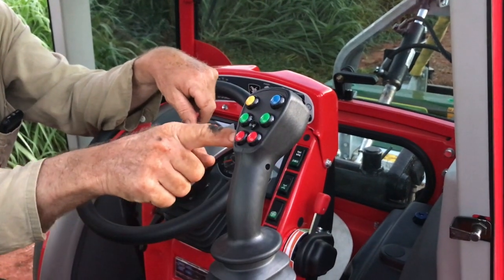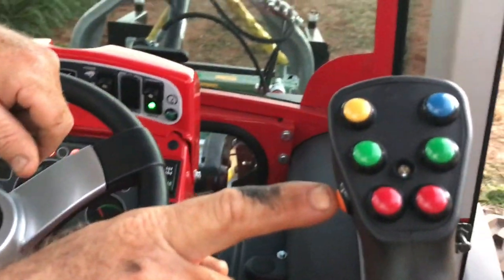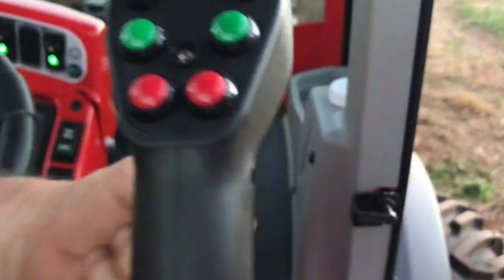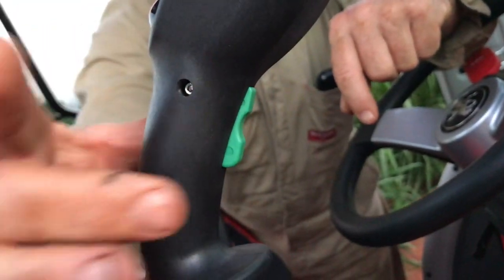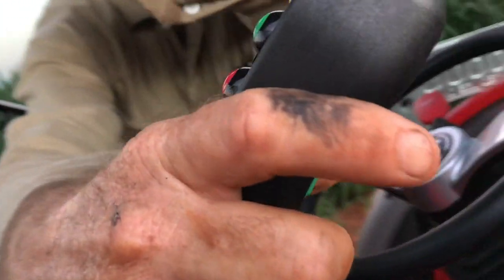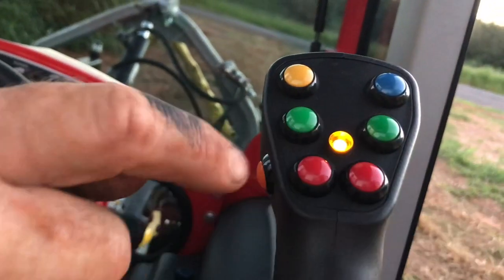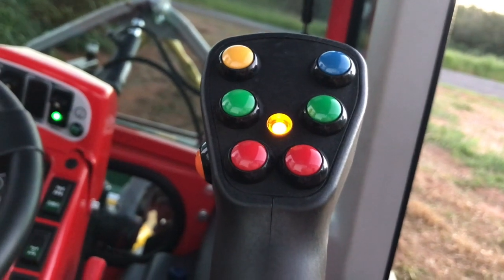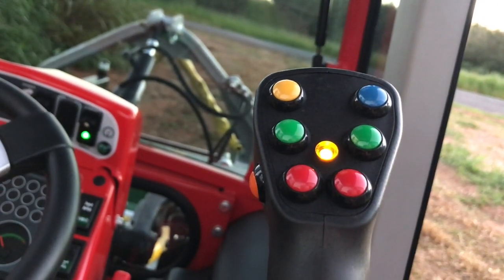See, there's a button on the side here, if you come around this side of the joystick. You need to pull your dead man switch, which is, if you go back around here, that button there. Nothing works unless you pull the dead man switch, right? Pull the dead man switch, and then back around the top, hit that button there, and it latches on. That's the float latch that we call it. It's a relay that latches in the float position, and that's how you must operate the load share.